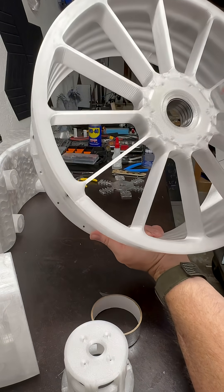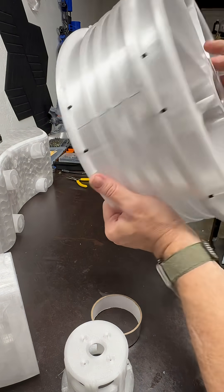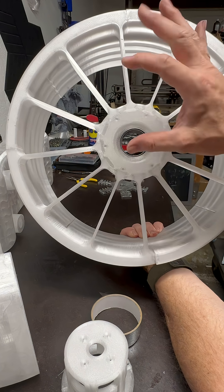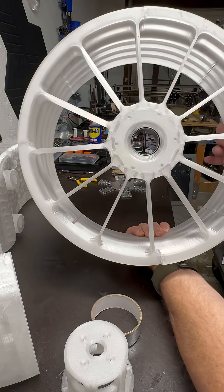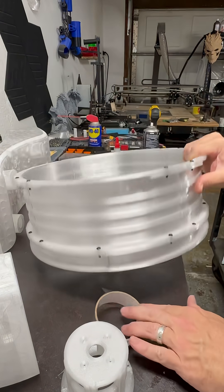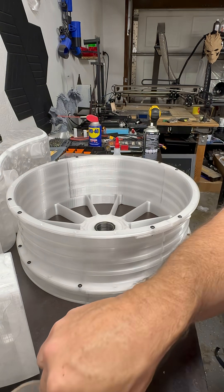We use silver tape around the outside to make sure it fits snug inside the hub. Then I have my stopper ring here, which sits just below the tapered roller bearing that's going to go there when the shaft gets attached. This is the tape I use right here — just keeps everything snug on the bearing side.